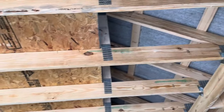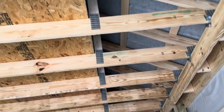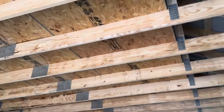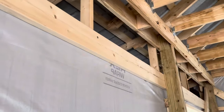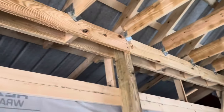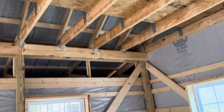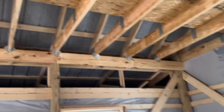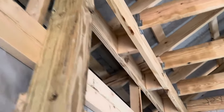We have a two by six, and we applied drip-stop metal that comes pre-assembled underneath the roof metal. We also have our hurricane ties up on this one — on the double top beam, two by eight yellow pine — those are H1 hurricane ties. This building is about 30 to 40 miles from Lake Erie, so it can get pretty windy out here.